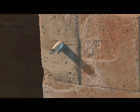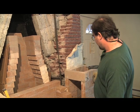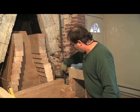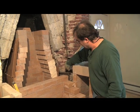And what we did was we wrapped these so there's a bond breaker between the steel and this cross piece. So the way this works in theory is these get embedded in the concrete pour that happens behind the core of the heater. So we have a tension link of the rod.